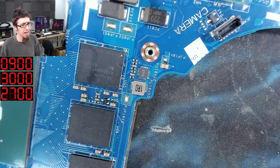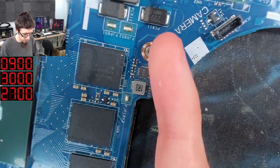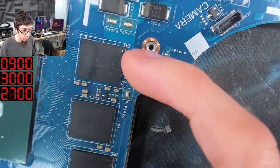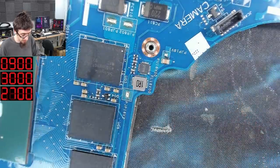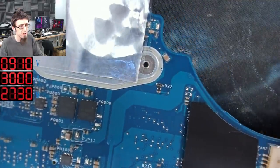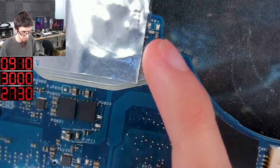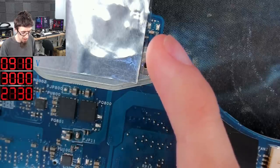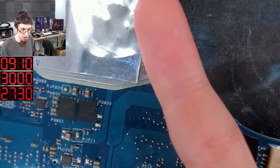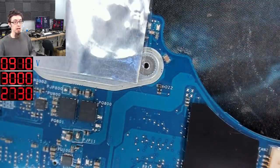So that capacitor, that looks pretty normal, this guy here. It doesn't feel hot, it's not burning my finger. Neither is that IC. So what about the capacitor that was on the other side of the board in that spot? Which is that guy there. Again, I feel like there's some heat there, but... Oh yeah, just about. It's really subtle though. If I pump 4 amps into that, it might go nuclear.